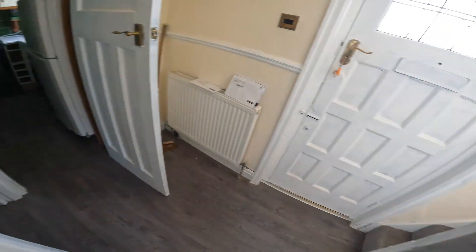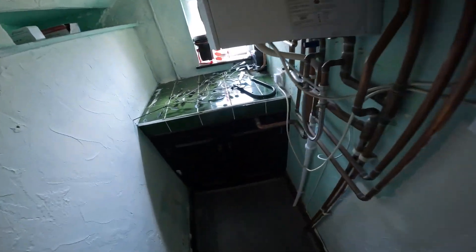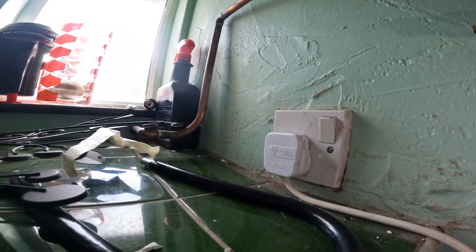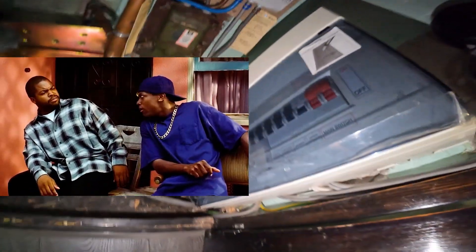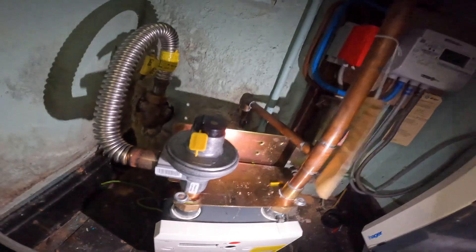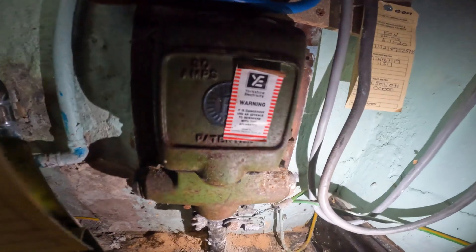Where's this fuse board then? It's back on one of these somewhere. Not in there - might get a disease from that cupboard. We've got the gas meter there, as you can see. Oh, what is that? Look at it - the guy would have had to just lay on his side to install that, because it would have just been sideways forever. You've got a gas supply here with no earth in, so it's not earthed. There should be a water stop tap with an earth to it. But here's your incoming supply - Yorkshire Electricity Board.